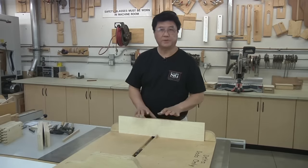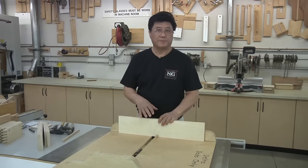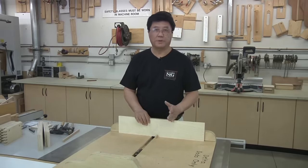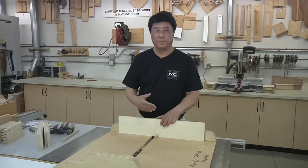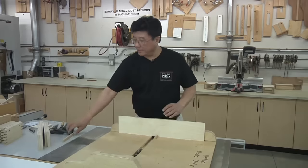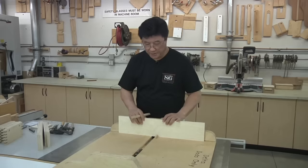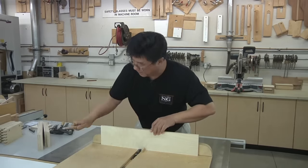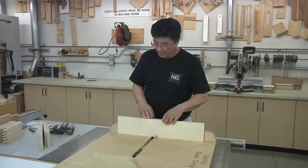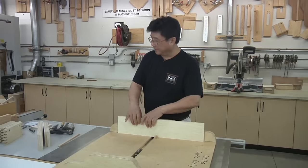I'm going to show you how easy it is to set our jig perfectly to meet our tolerance. Remember, I want the fingers of my box joints to be about 5 to 6 thousandths of an inch smaller than my opening, which is 0.365. So my target is going to be 0.360 or 0.359. I'm going to grab this piece we cut off earlier for our spacer — knowing that this is 4 thousandths of an inch smaller — place it right up against one of my teeth, and this will get me close for my first cut. Now I'm going to purposely mess it up so that it gives me a chance to show you how to bring it back in. I'm going to clamp it.